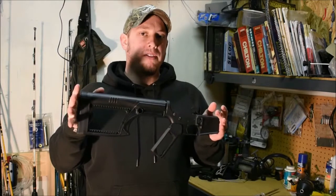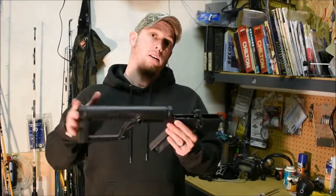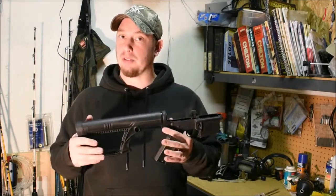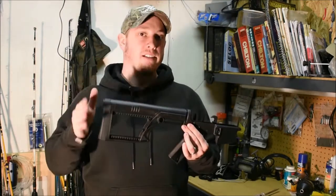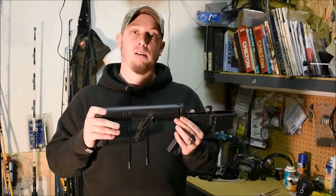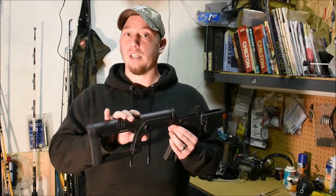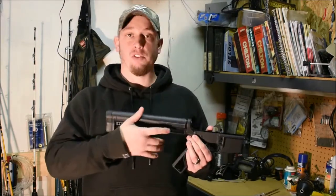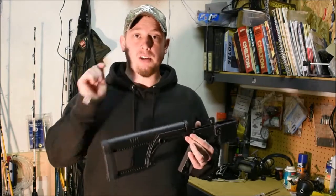I'll put the link for where I bought this fixed stock in the description. I think you can usually get a hold of this thing for about $50, which is fairly cheap. And a quick note for those of you looking to build an AR-15: this is a fixed stock, not a collapsible carbine stock. If you go to get a buffer tube kit for building your rifle and you plan on getting a fixed stock, there is a specific buffer tube kit — it is a rifle buffer tube kit. When you go with a fixed stock you go with a rifle buffer tube kit, which has a longer buffer. If you want to go with a regular collapsible stock, you will get a carbine buffer assembly, which has the slot and holes for the different stops in your collapsible stock. So just so y'all know, if you do want to go with a fixed stock, you do have to get a rifle buffer tube kit.